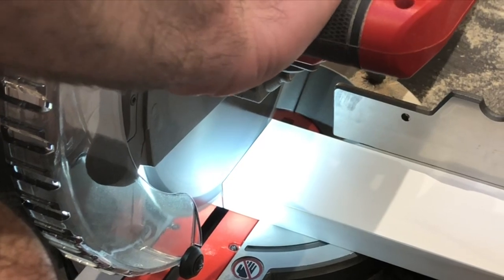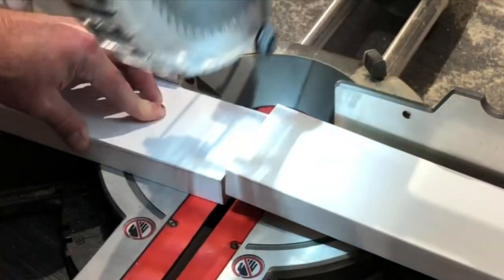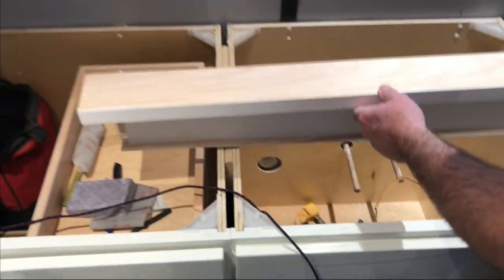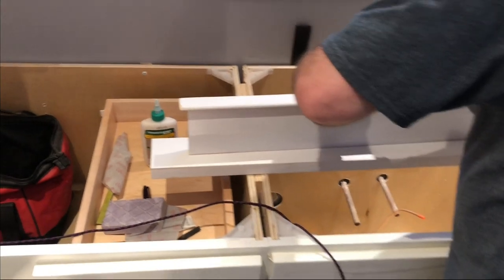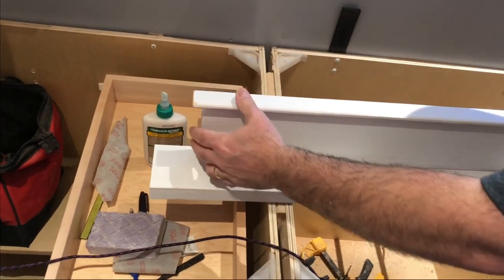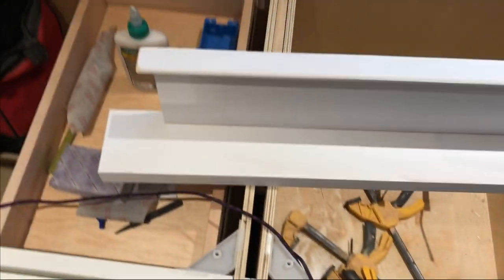Now, the measurement for the top board of your cornice is easily taken. That measurement is 5 inches longer than your frieze board. That extra 2.5 inches on each side makes for plenty of spacing to attach your small crown molding and still have a nice overhang beyond that.